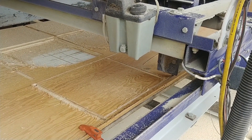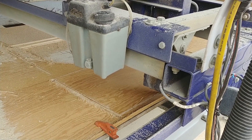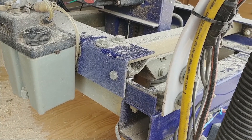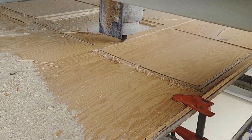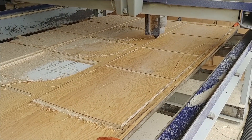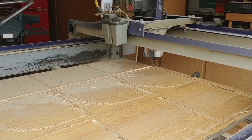We are once again in real time. I got a little more courageous and I'm cutting at one inch per second — a little bit faster than when I started. I got a good idea of how fast I can cut, and with a proper cutter I'm going to be able to go much faster. Let's speed this up — enough of those nasty-looking plywood cuts. It did take me longer to do this with the router than it would have if I had done it by hand, but I was pretty pleased with it. That is the last cut and I've got it done.